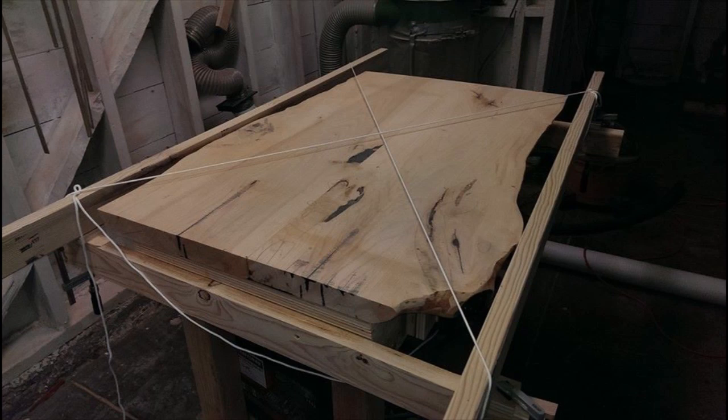So when those two strings touch in the middle, that means there's an X, and then you put a couple pieces of the same rope to make sure that there's one string length apart. As soon as you move that fourth piece up and down, it will then very minimally touch, and that's when you know you have a completely flat surface. There are many videos on YouTube explaining this exactly. I would highly recommend looking at the Wood Whisperer's one on how to make a leveling jig, because he goes into much more detail than I'll go into right now.